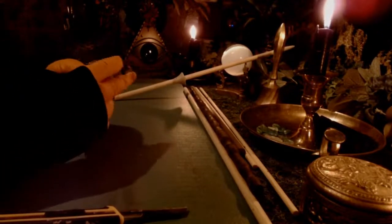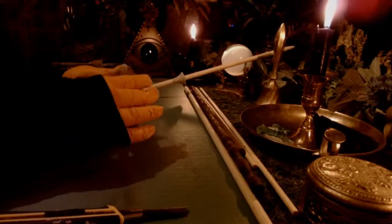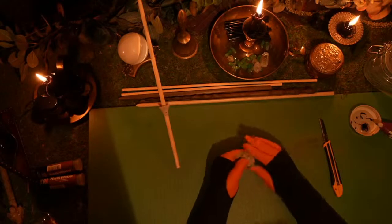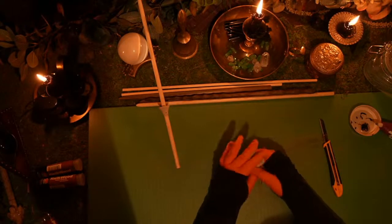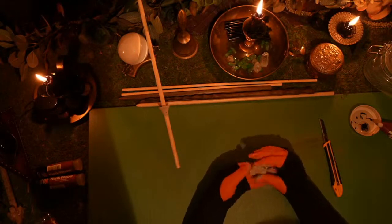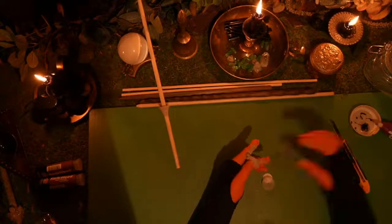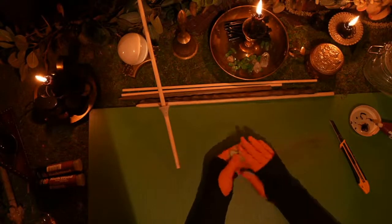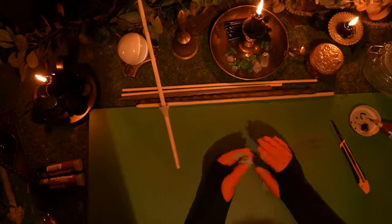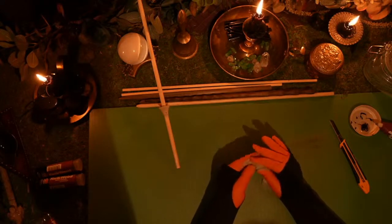I'm always nervous to mix it too much, because then the set time is like insanely fast. And also, it's important that I cut the putty instead of pinching off a piece, because you need to have a 1-to-1 mix. So I'm just gonna keep mixing this until I can feel it through my gloves, which I have very thick mill gloves on. It's kind of getting warm.